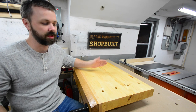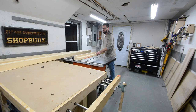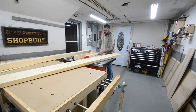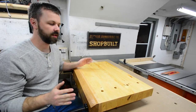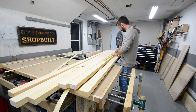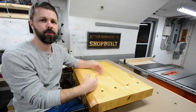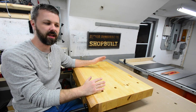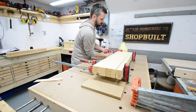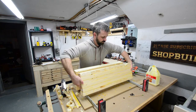To get started on this project, I ripped two 2x10s into six 3-inch strips. Because the 2x10s measure 8 feet long and my bench top is 30 inches, I took the best two 30-inch pieces I could get out of each 2x10 to cut around the knots and get the best possible material. The glue up for the top was pretty straightforward — I took six boards and glued those together, then glued six more boards together, and then glued those two sections together, and that made up my bench top.